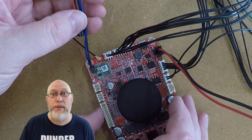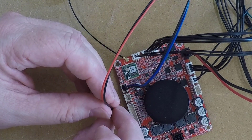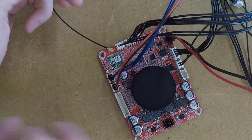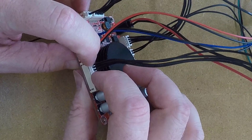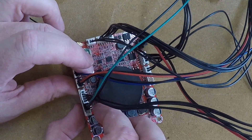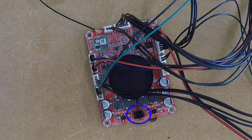Moving to the left side, the first connector is the Bluetooth LED light — this is your black and blue wire. The next connector is a black and red wire; this is your charging LED connector. The final connector on the left hand side of the board holds both the auxiliary input cable and the power LED cable. Start with the auxiliary input first, and then the power LED with the green and black wire — you'll have two unused pins. Now there is a connection at the bottom of the board: the speaker wire connector. Pay careful attention to the instructions — all four of the wires on the connector are the same size and color, so it's easy to get them mixed. I'm not ready to plug in the speaker wire connector yet, so hang on — we'll get to that in a little bit.